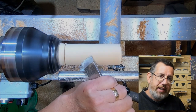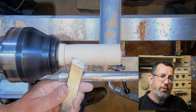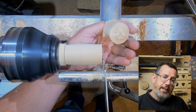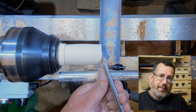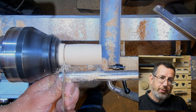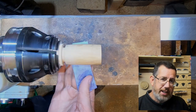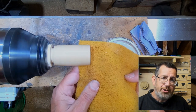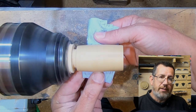I'll then flip that around in the lathe and shape the body with a straightforward tapered top and bottom — I've seen some people just taper the top in and keep the bottom wide, it's down to personal preference. I'll then cut off the excess from the bottom. It's handy to keep that piece because you can use it to turn down for things like a nose or hands. The best way to make the bottom as smooth as possible is to use the skew with a knife cut — the point of the skew cuts right through the fibres and you get a really nice smooth finish with no tear-out. Then just normal sanding, sanding sealer, knock it back with an abrasive web, and Wood Wax 22. Finally just parting off — as long as the hole drilled in the top is deep enough, you haven't got to worry about that, so just be careful when you drill.